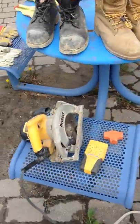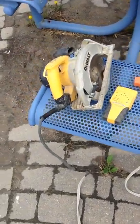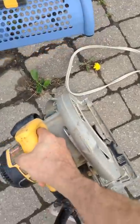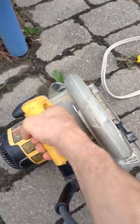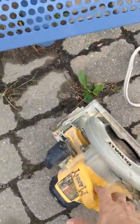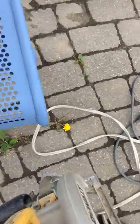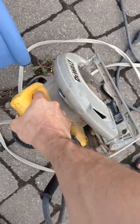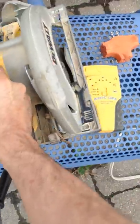Here's my skill saw. A quick tip when buying one: you want a skill saw that's reasonably heavy in weight — not too heavy, but definitely not light. If you're cutting lumber and there's a nail you don't see, a light skill saw can kick back at you with the blade still turning and cut you. That's a very common injury. A heavier saw with a good grip will keep it from slashing you when it hits a knot or a rusty nail.